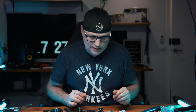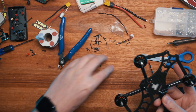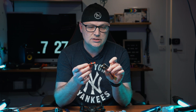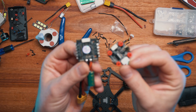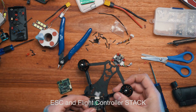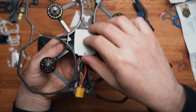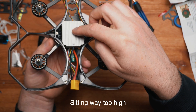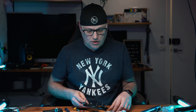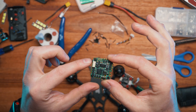It's been a few days now since I started this little project of mine and basically there were a few stuff-ups. The first thing that went wrong: I used my flight controller and ESCs. These are the two components, and when I pop them into the actual frame, once everything stacks up on top, the air unit doesn't fit anymore. The problem is the frame is too narrow for that double flight controller setup.